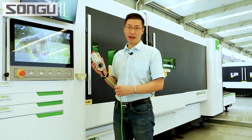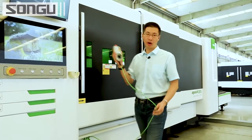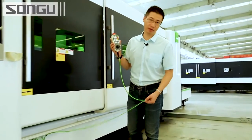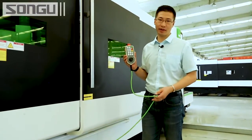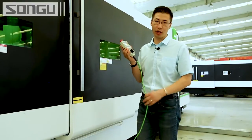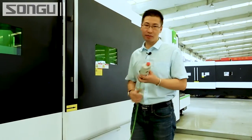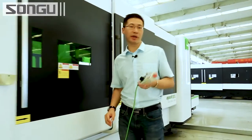This is the S-Cat handset controller, equipped with a 5-meter long cable. Why do we keep this cable? The reason is for safety. When any emergency happens, one second is important for life. With this real-time control cable, you can stop the machine immediately with no delay. This is very important.